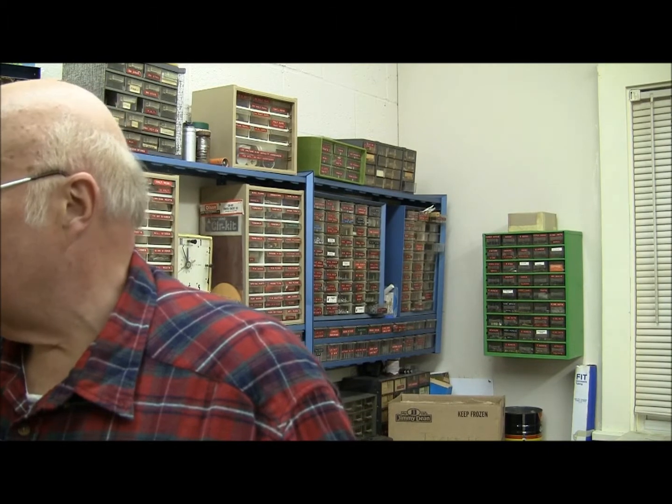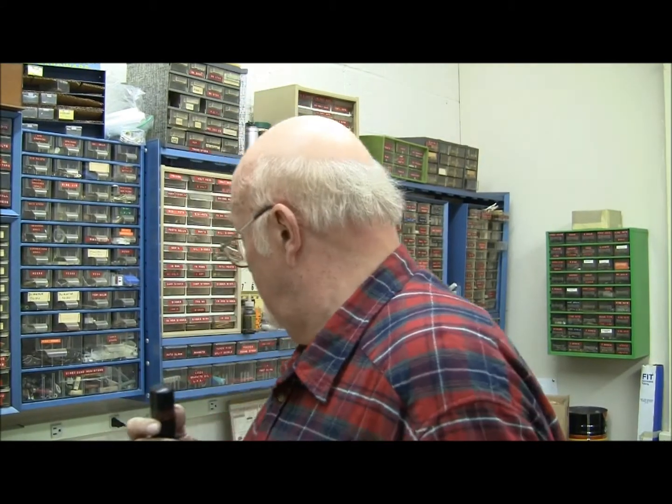There are other tubes here tonight. This is a common tube used in old audio amplifiers, but also in amateur equipment. As seen in some old handbooks, you can make a transmitter with this — it's a 6L6 tube, a much smaller version. The 6146 can probably give you 60 watts out if you really load it, while the 6L6 might give you 20 to 25 watts normally.